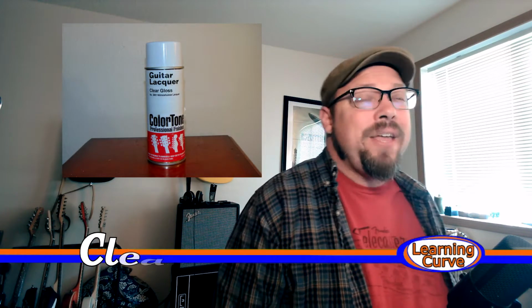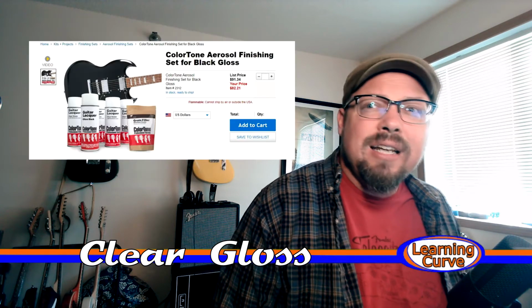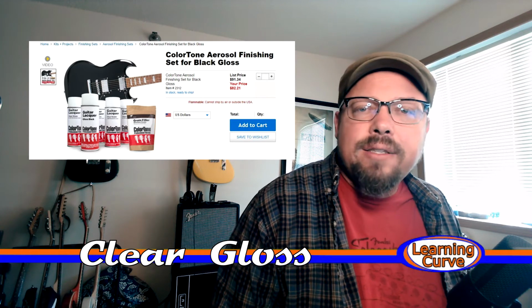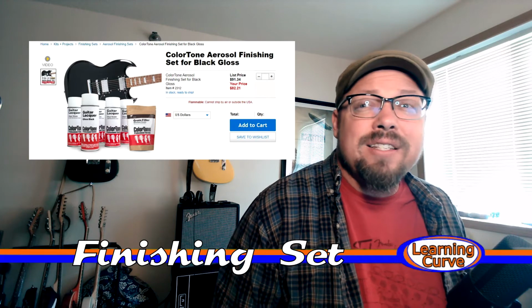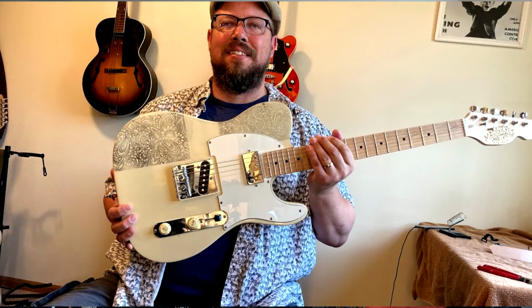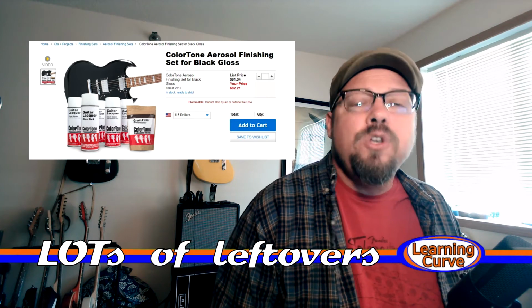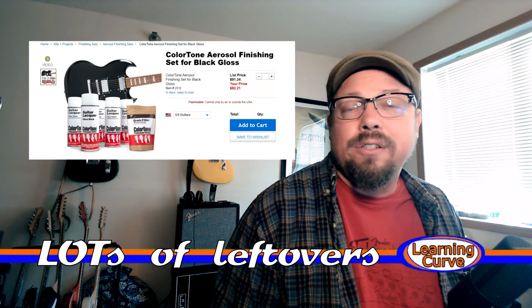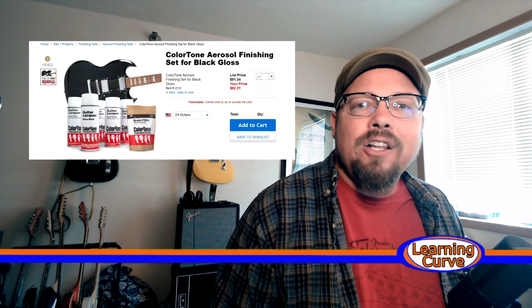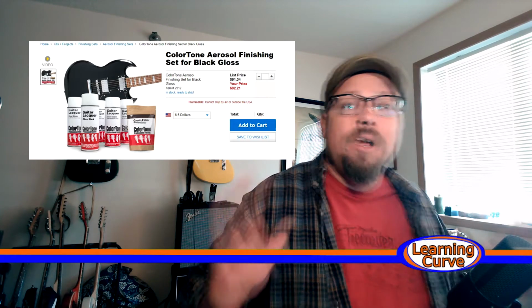Also, I still have clear coat, so if you find yourself looking for guitar finish and you see one of those color kits that StewMac sometimes has on sale, I gotta say, the color they sent wasn't my favorite. But I got so much out of the kit, and I still have wood grain filler too. You can do so many guitars with one color kit, especially if you're willing to buy a different color. The pigmented color is the thing you use the least of when you're finishing a guitar. So, shout out to StewMac.